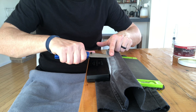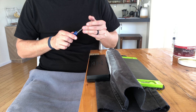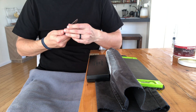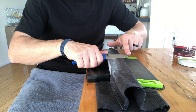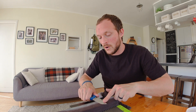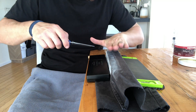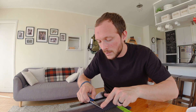Being able to feel and identify a burr is still very valid and important, especially for lower Rockwell steels. This is 61 Rockwell and it's actually taking a little more work to deburr than the Spyderco mule did. If you've still got a bit of burr it may indicate you didn't go high enough in your angle — but it's better to do that and not touch the apex than to overdo it and remove all that aggression. I had a fairly significant problem to fix and came back with one really gentle stroke.